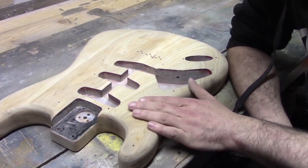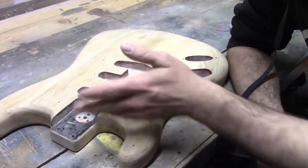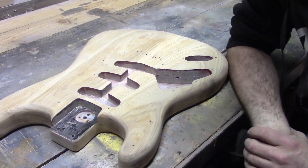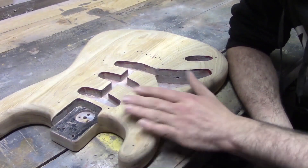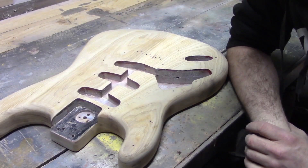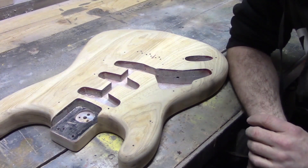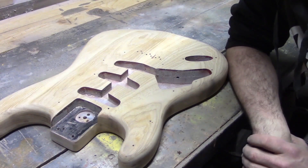If we just use our stains, it'll keep it nice and thin, then we can put our white layer on, and as we chip away at the white layer it'll expose the black and maybe the yellow and reds in certain places. Instead of using a tough 2K lacquer, we're just going to use a very light coat of clear coat, so it'll age well and take a few knocks and show some nice wear, and over time the little dings will start to show up a bit more. Hopefully by the time we've done all that, it'll be back looking exactly how Pete wants it.